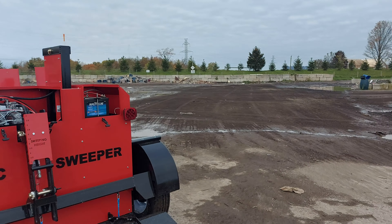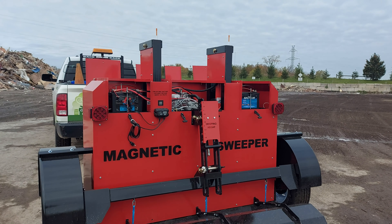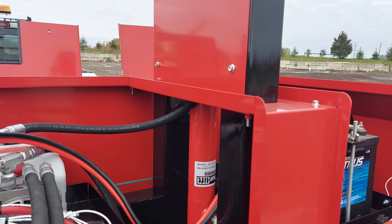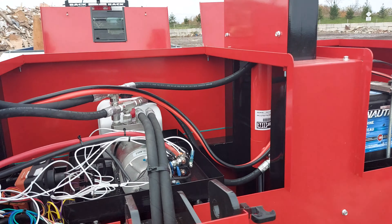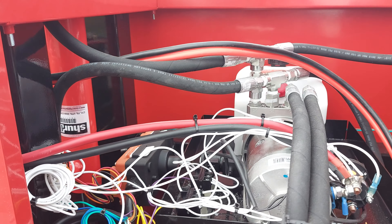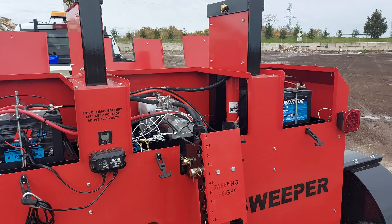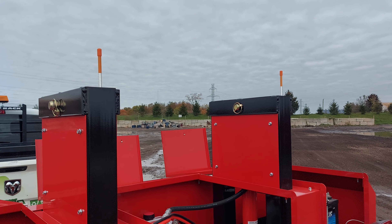After we've gone through grooming this yard, we've also had the magnet deployed. Using the hydraulic rams inside of the Mammoth Magnetic Sweeper, which is powered by two deep cycle batteries, we can use the rams to separate the 12x12 magnet assembly from the stainless steel debris pan, which can be monitored from the truck cab by watching these two indicator rods on the top of the magnet.